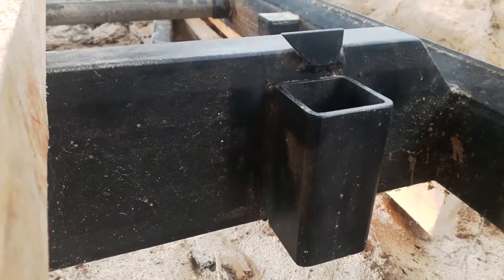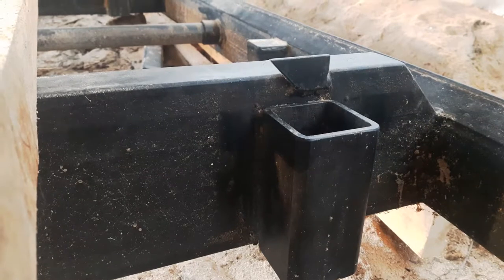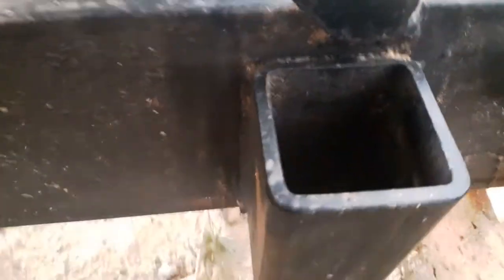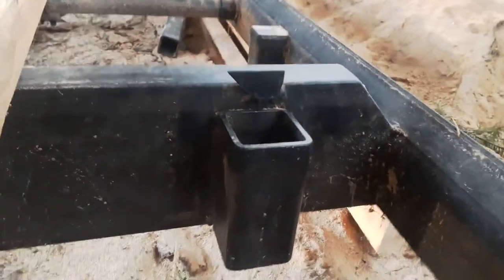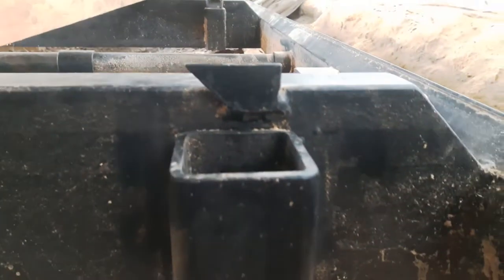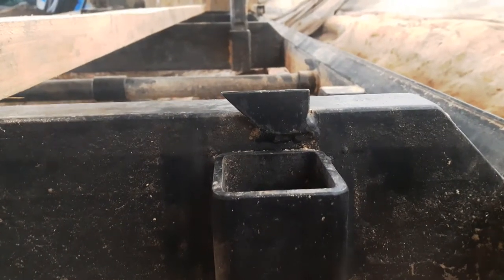I was going to make the back rests for the logs on one common rail that could be flipped up and down, but I ended up going this way, which isn't too bad. I've got pockets that are welded to the side and just one plate across the bottom, because I didn't want them to retain any water if I have the mill in an uncovered area — just to help with corrosion and that kind of thing. The little log dogs on the back stops line up the same with the edge of the back rest.